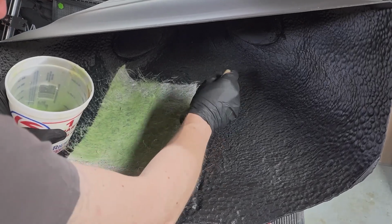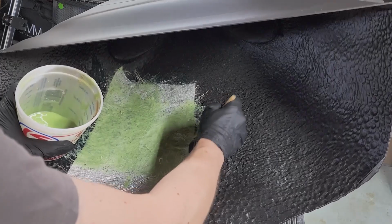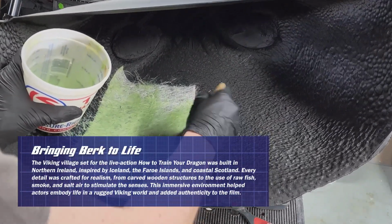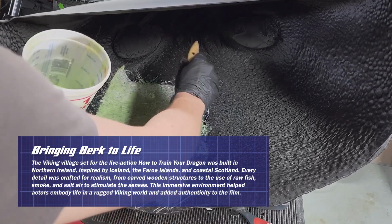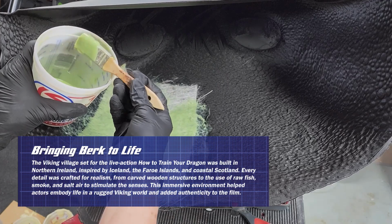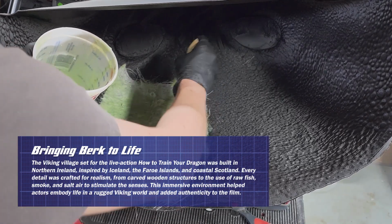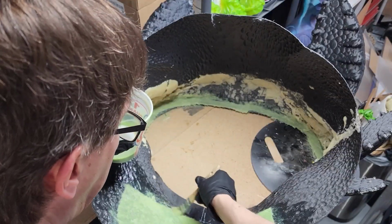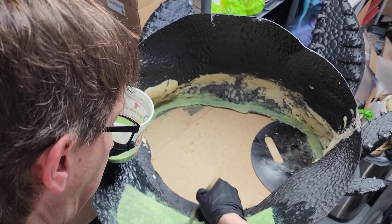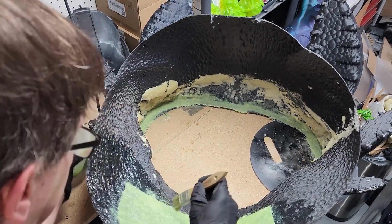Like the legs, the head needs to be reinforced. Since actuators are pushing and pulling on the jaw, there will be a constant force on the head, so it needs to be very durable. For this, I chose to use fiberglass. I'm using UV resin with the fiberglass mat instead of the typical polyester resin. The UV resin is much faster to cure, seconds versus hours or days, and isn't nearly as strong smelling as the polyester resin. I've used this process for years to reinforce prints. One layer is usually enough that a print would survive being dropped on concrete, but I'm playing it safe and using 2 layers inside of the head.